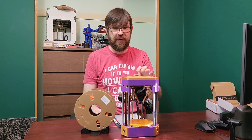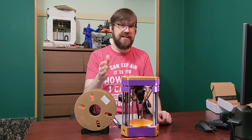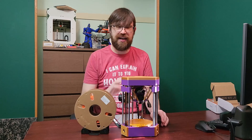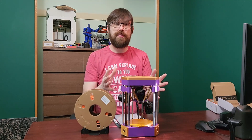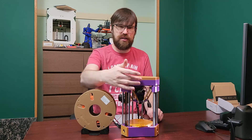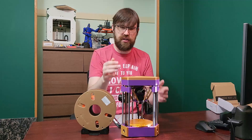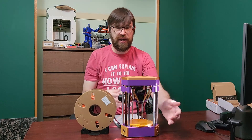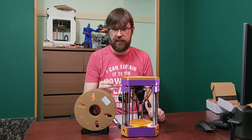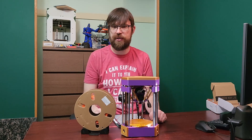It's a very cool little printer and I hope all of you will enjoy building it. There is going to be a proper 120 millimeter size version coming soon. Most of the parts won't change — essentially all I'm going to do is split the body and add a 50 millimeter section on the corners, gaining 50 millimeters of build area. The rods will change from 250 to 300, and there you go — a 120 millimeter delta.